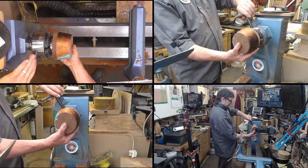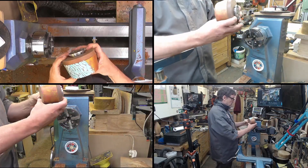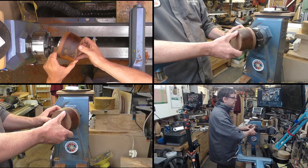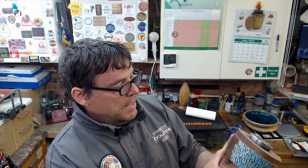Let's get it out of the chuck and see what we've got — I'm going to keep it on the screw chuck. Might get one of these treatments all the way around. Starting with the stains: they absolutely do have an effect. You can see it there against the wood — it certainly darkens it and there is some colour showing through. Coloured waxes — well, that's not a surprise; they're quite thick and pasty so they should stand out. The paint — a couple of Chestnut iridescent paints gone on there, red and yellow. I think that's my favourite one, I really like that. Maybe with some fine black crackling over it — maybe overkill. And then the last one: just a little bit of gilt cream — well, that livens it up a little bit.